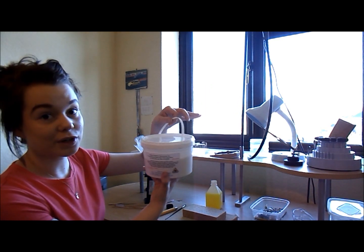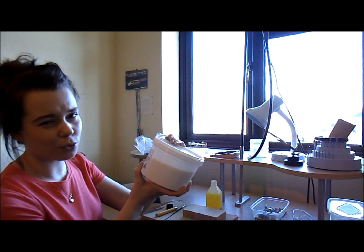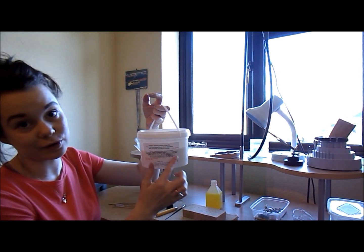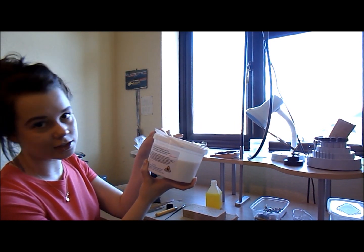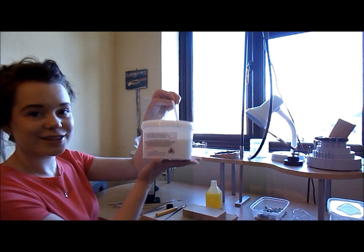With your safety pickle you get this big white tub. If you want to use it in your slow cooker, you need one litre of warm water and 50 grams of pickle — it does say on the label if you forget. The best temperature for it is 30 to 80 degrees, but not above 80 because then it doesn't work as well. That's the easy pickle!